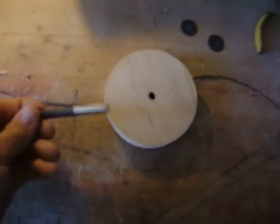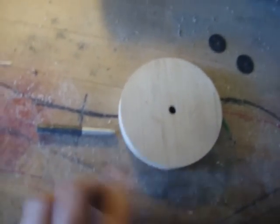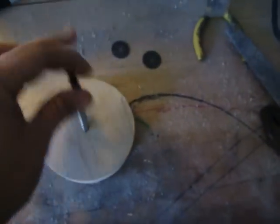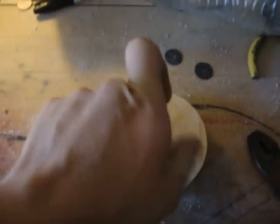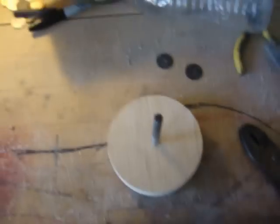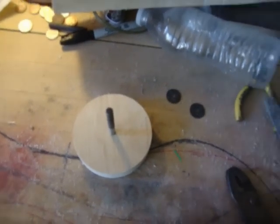Well, I have completed tapering the shaft. This is the shiny area where it's been tapered. Now it fits into there and will be hammered in for a tight fit afterwards, but I still have more stuff I need to do before then. It's still quite hot from the turning process, so I don't want to touch it any longer than I need to.